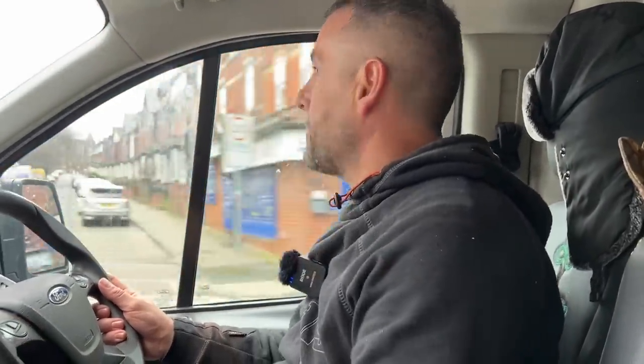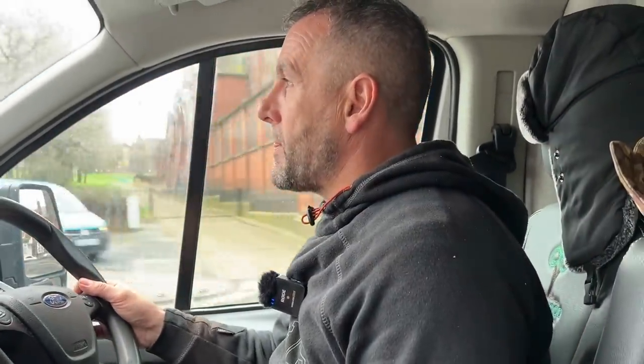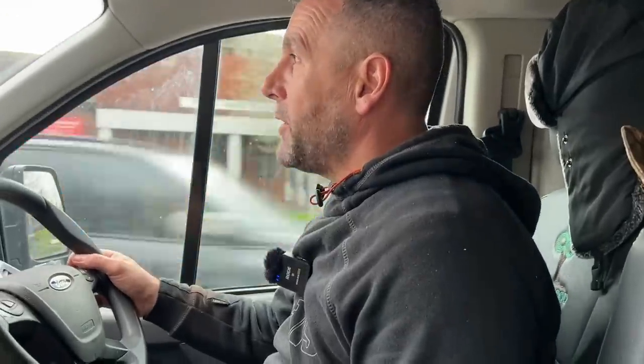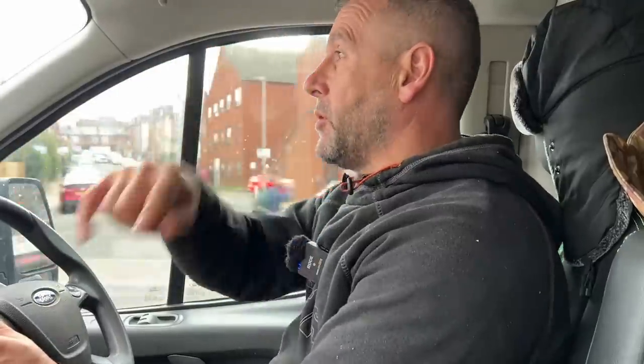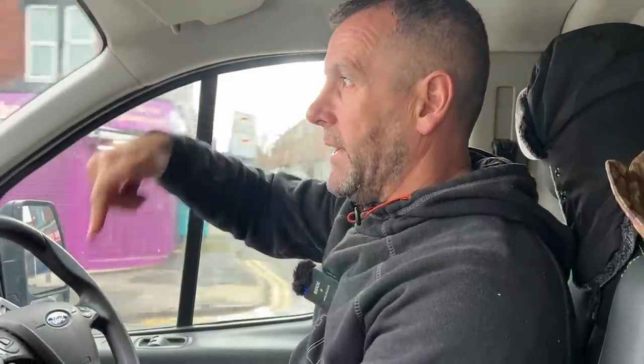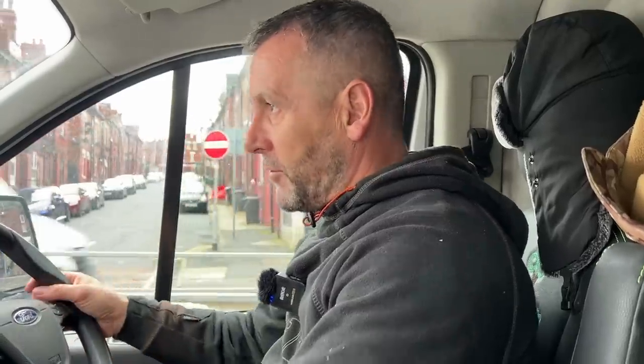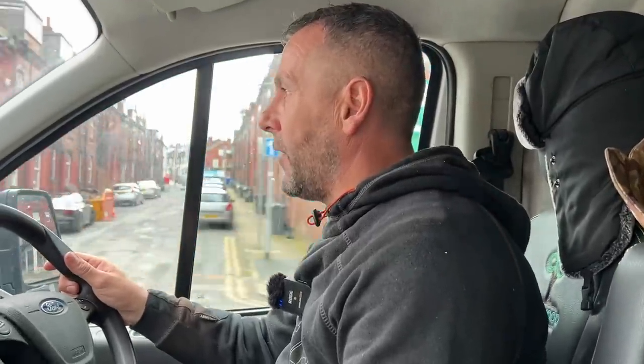Rob Stubbs asks: when fixing walls to the floor, if you fix more towards the inside you may miss the floor joist and only get fixing through the flooring. What we do: put a screw at each end first - that normally secures even a six or seven metre wall from falling over. Then go along, put one screw in each bay to compress it down to the floor, then nail it - that'll go into the 4x3 anyway. The wall is positioned directly above the 4x3, then we screw it down and nail it because screws alone aren't sufficient.